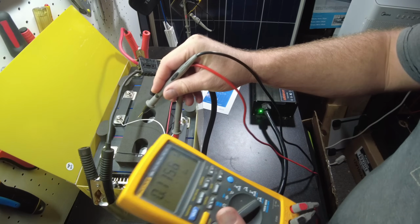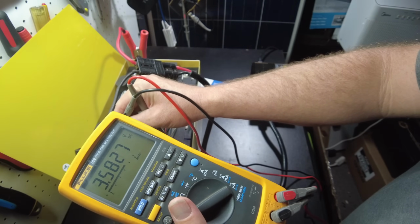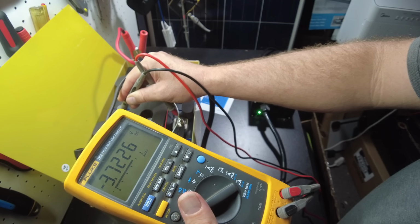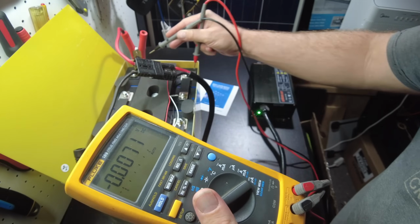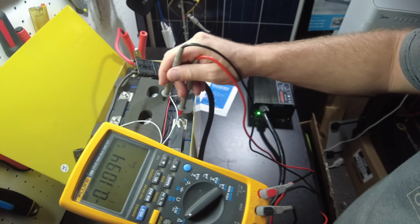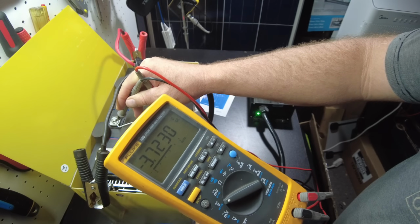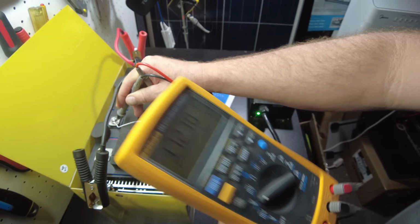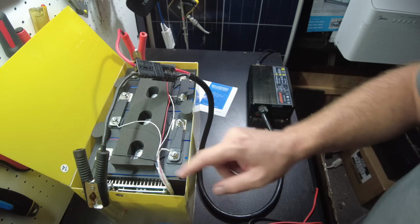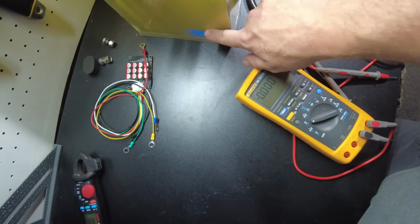All right, let's see here. Look at there, we got 3.58. Oh, a little high there, 3.72, 3.67, 3.63. Really close. It's letting this one go a little higher than what we probably usually like to see. I'm still okay with 3.7. I've seen some actually allow the cells to go up to 3.9, so maybe that flashing is an indication of it balancing or something.